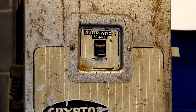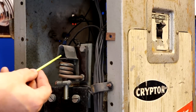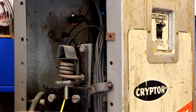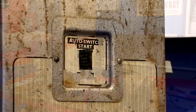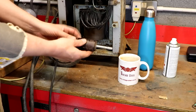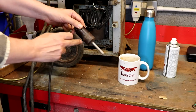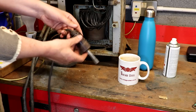I'm going to test that idea without actually short-circuiting the output — I don't want to risk damaging the rectifier. Instead we'll just simulate an overcurrent by manually lifting the plunger to close the switch contacts, which should trigger the main switch off. And it does — it switched off. The temperature probe appears to be wired in parallel across the overcurrent switch contacts. So I think there's a bimetallic switch inside the probe — you insert it into the top of the battery, and if the electrolyte starts to boil due to overcharging, it should make the charger switch off in the same way.